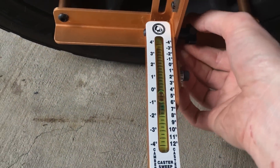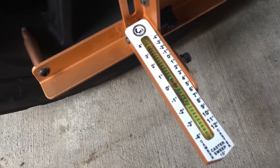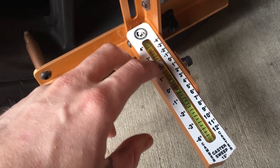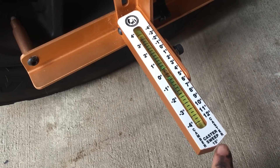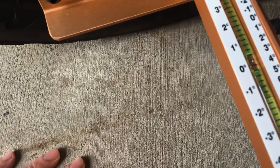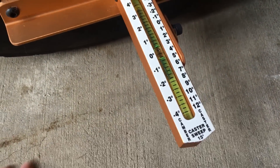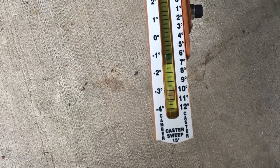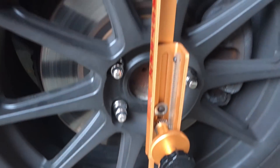So I come over here and zero this out. Because I'm not on level ground, I can't get it to go to zero, but the idea is to get this bubble to go to zero. Then we turn it back the other way and read it. To get an accurate reading, we see what degrees we are at now — three and a half — and just subtract that from whatever reading we get. We measured that right around ten and a half.